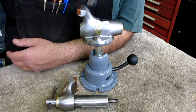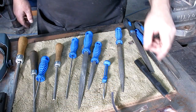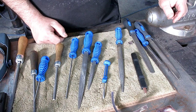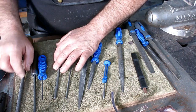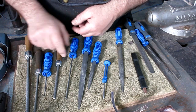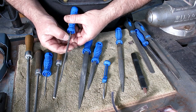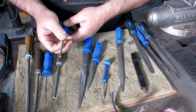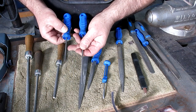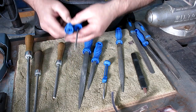The next question was about the files and abrasives I used. These are the main files I used doing the file work on the baby bullet. You've got your basic round files — some people call these rat tail files. I've got a couple different sizes. This one is a chainsaw file, about 5/32 diameter, around four millimeters. What differs from a regular round file is that a chainsaw file is the same diameter all the way down, whereas round files taper.